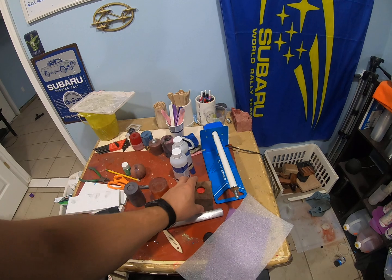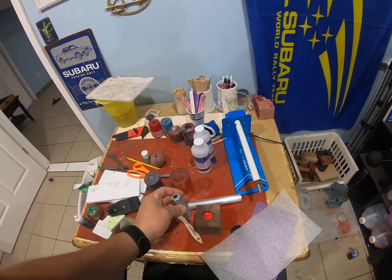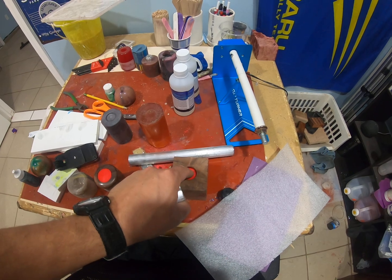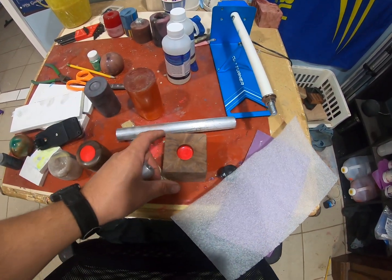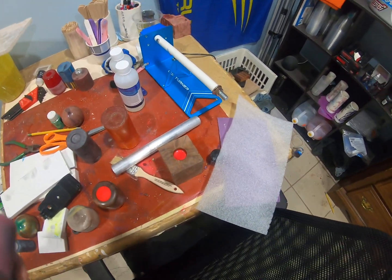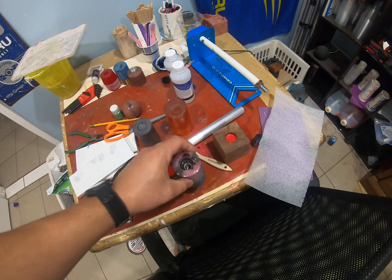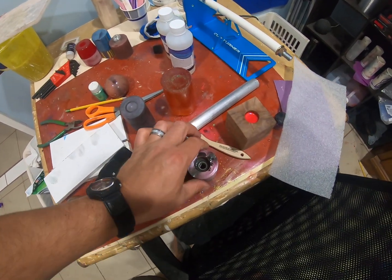After I have drilled a 1-inch hole in it, I then can set the insert into the piece, whether it be resin or wood, and then I over pour it with resin to seal it into place and lock it into place so that that doesn't go anywhere. Once I have that done and cured for at least 24 hours, I then re-drill and tap the insert that's in there. I've lately been filling them with hot glue prior so that it's easier to clean the threads out.